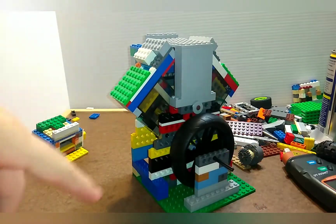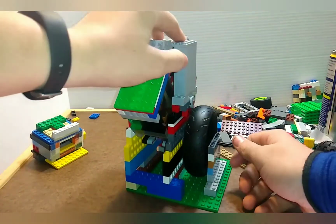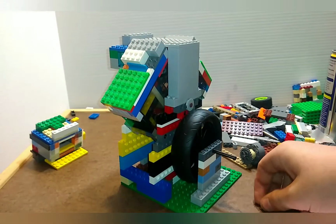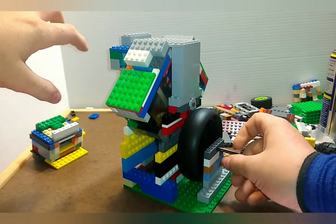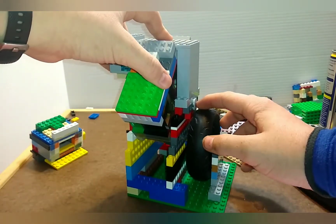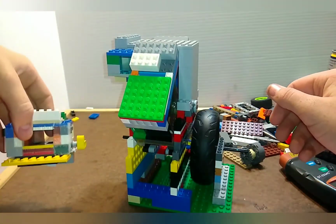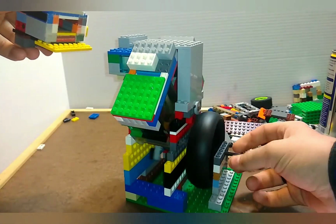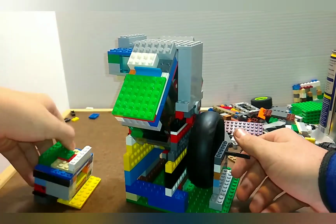Also, as a side note, I ran this engine without lubrication for a long time, and I was measuring about 2,200 RPM redline on the tachometer, but when I added the oil to it, instantly 2,500 RPM, easy, measured with the tachometer. I'm going to run it with the throttle first, so you can see how the throttle response is on it. Then I'm going to run it without a throttle. So we'll just have to see. Hope you enjoy.